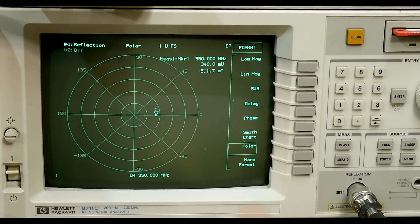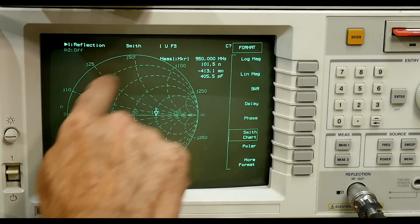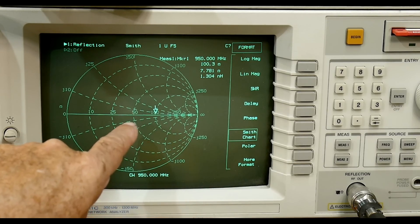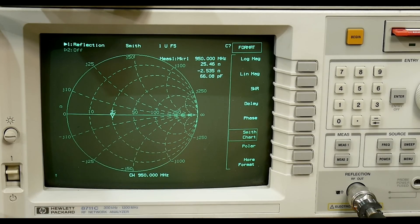I did a quite detailed video on the mathematics of Smith charts. If you plot VSWR on a Smith chart, it's constant circles — bullseye circles — and that's because all it is is a rotation. This 100 ohm resistor is going to be a VSWR of 2 to 1: 100 divided by 50 is 2, and 50 divided by 25 is also 2. So these are VSWR curves of 2 to 1 VSWR.